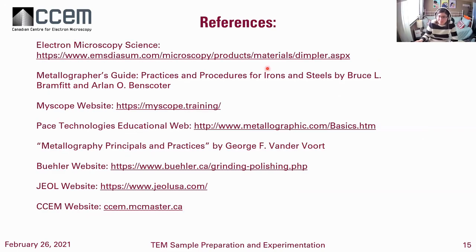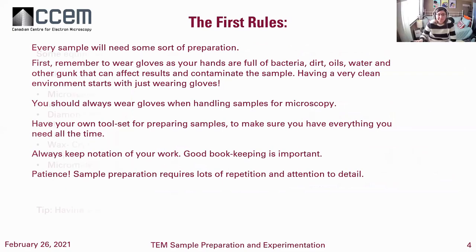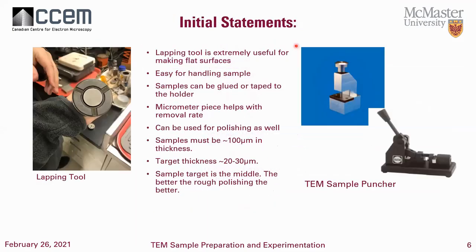If anyone has any questions, please place them in the chat. There's a question: why are you using kerosene for polishing? I found kerosene doesn't have as many issues with cleanliness, and it has a little more of an oily aspect to it, which gives a little more leeway in terms of aggressiveness. You can use any alcohol — I like kerosene personally because it's a little nicer to work with and it doesn't dry too quickly. You can also use isopropanol — that will probably work pretty well too. I find ethanol to be better for cleaning purposes.